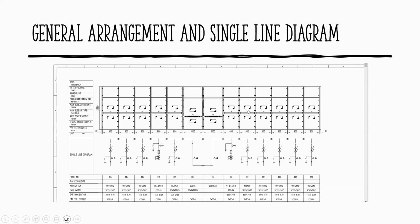I believe this is GE, the one that we commissioned and handled before, maybe around 2012. This is the main enclosure. Inside you have the single line diagram. It shows the joint of the bus bar, joint per panel, compartment design. You see the CT over here, CT, earth switch, and also the outgoing cable, and this is the bus tie. Initially from the design, the client will provide this, and we will provide the specs of the CT, the specs of the breaker, VT, and whether this is metering VT or metering CT or protection CT. We call this the bus riser.